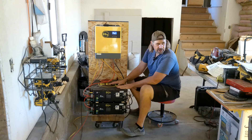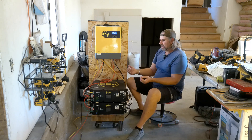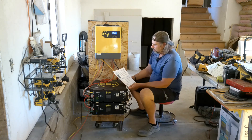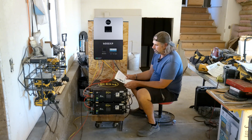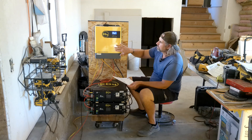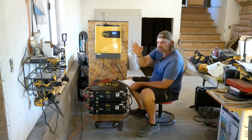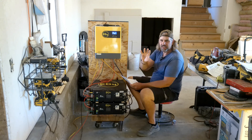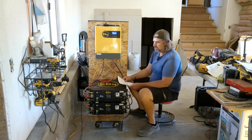I've been really impressed with these batteries. One thing I'd really like to do is push them harder and see how much power I can get out of them — but this 3000-watt inverter won't allow that. So one of the upgrades I want to do is get the 6000 XP off-grid inverter, which is good for 6000 watts continuous. These are pure sine wave inverters — unlike older modified sine wave or even square wave inverters that put a buzz in your speakers and TV, pure sine wave gives you clean power.